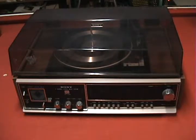So there were two standards that were adopted for vinyl, which was the CD4, also known as the Quadradisc standard. And this behaved like a stereo, which had a carrier signal. So you had the stereo tracks, and then the carrier signal was taken in by the demodulator, and that split it up into four different tracks. For the four tracks, left back and left forward came out of the left track, and then the right back and the right forward came out of the right track. So you broke the two tracks into four tracks.